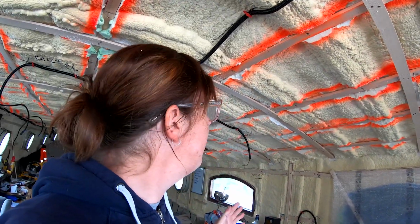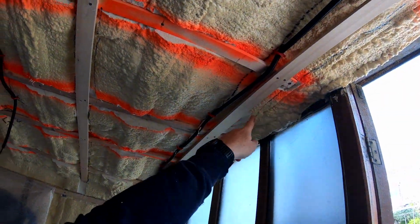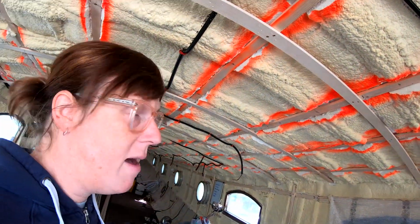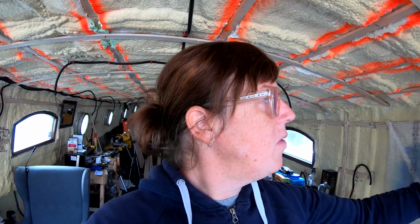But I've just measured up for the cladding, for the tongue and groove cladding. It's 13 meters from the first batten, from just here, all the way to the bow. Well, at least the inside of the roof. And the boards themselves are 85 mil, or 8.5 centimeters, in width, without the tongue piece and the groove piece, so across the face. So yeah, they're going to fit over.